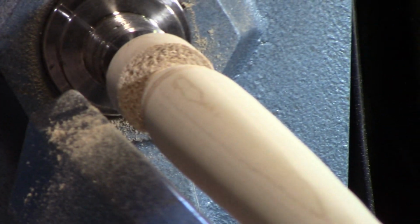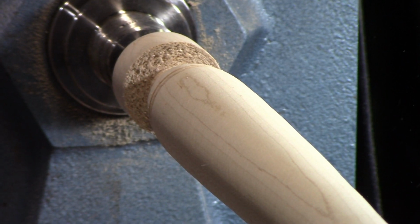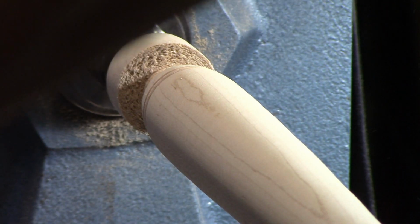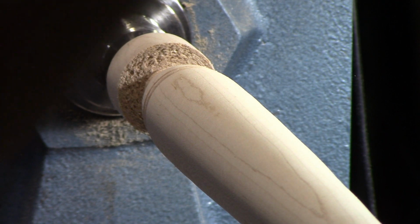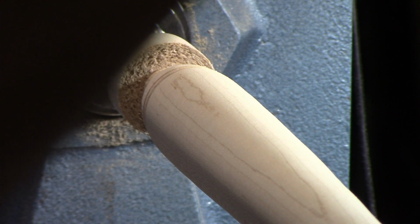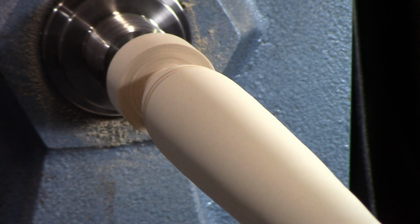Then what you can do is, I've got a piece of wire here that I put handles on. Basically, all I did is drill a hole through the dowel rod. You never want to hold these things in your hands, because if it grabs on it, it's just going to snap your finger right off. Basically, it's just a matter of turning these on, putting the wire in the groove, and holding it there till it burns.